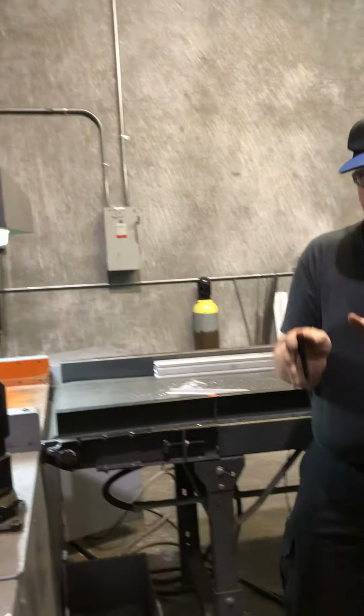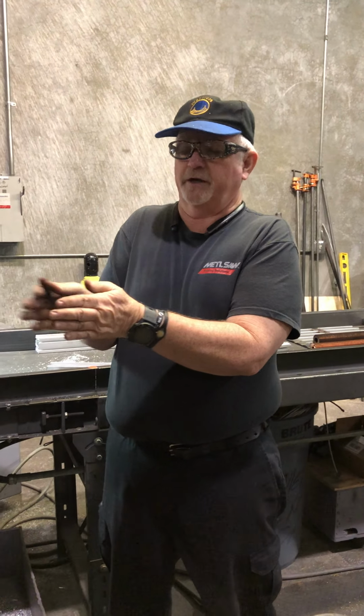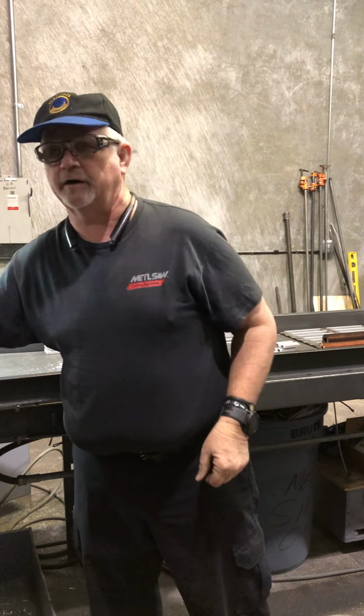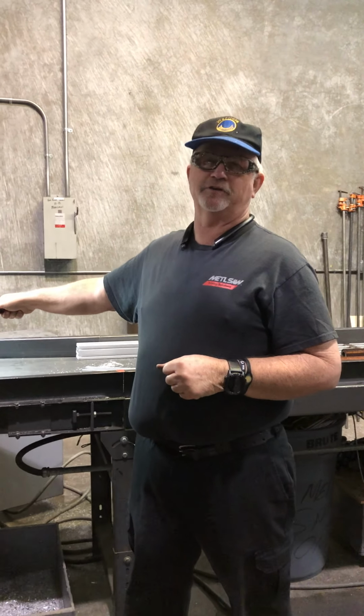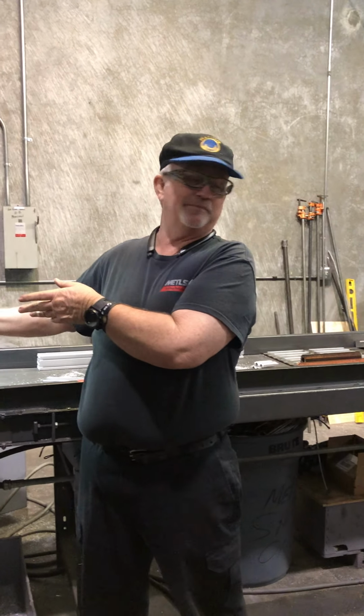So I showed you the auto home position, right? If you're going to a smaller blade from a 16, say you put in a 12-inch blade from a 16 blade, and your auto home is 12, okay? And you put in a 12-inch blade, it's going to go where it thinks it's 12 inches from the front of the bigger blade, not the smaller blade. So you're going to be further away. But just the opposite, if you're telling it to go 4 inches in that direction, it's not going to do that. It's only going to go 2 inches because it thinks it was at the 4-inch position.